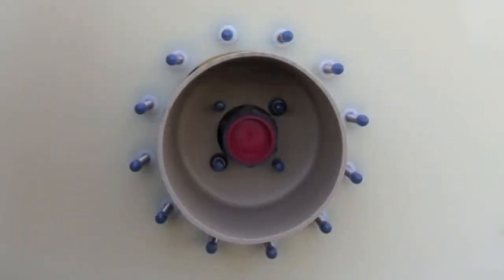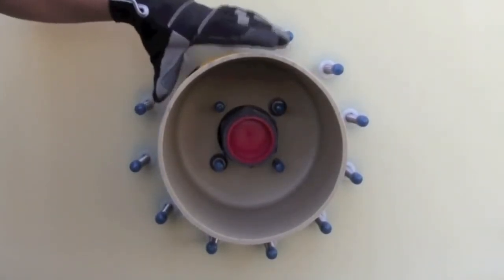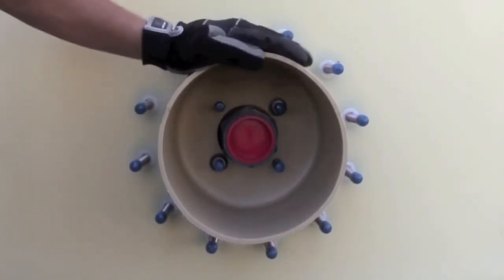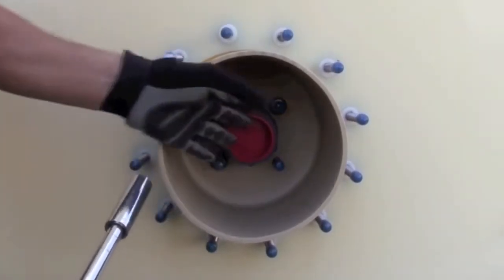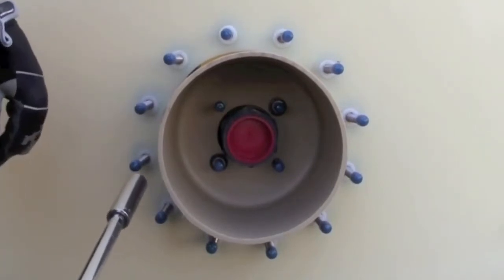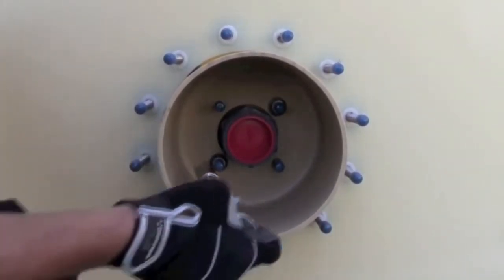Now that we've laid out our parts and tools, we can begin the assembly of the transition fitting. The first thing we'll need to do is remove the alignment sleeve that is installed for shipping purposes to keep the two tanks aligned. There are two nuts inside the interior of the alignment sleeve that are holding the sleeve against the primary tank fitting. They need to be removed.